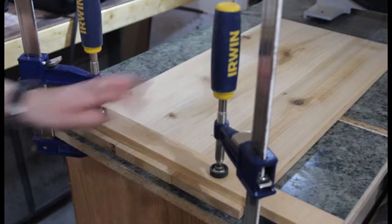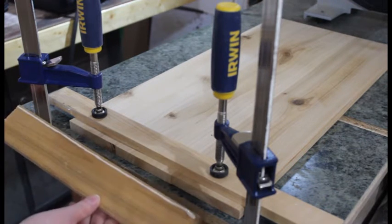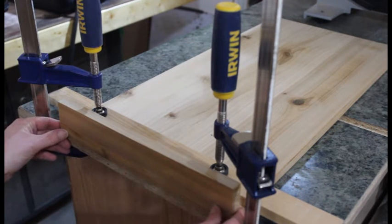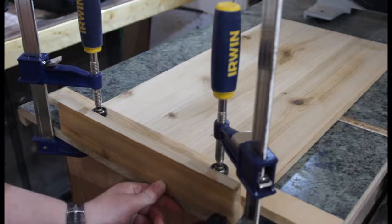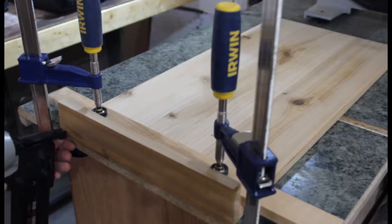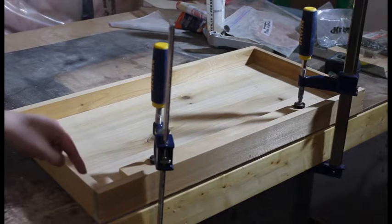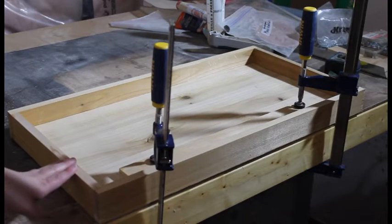I forgot to mention that you do want to sand the top and bottom before installing your side rails. I put a little dab of glue — I had to clamp mine down a little because my boards are slightly warped, but once everything is together it'll be okay. I'm using 18-gauge inch-and-a-quarter nails, one on each end and one in the middle. For the long pieces I lined up one edge, made a mark, cut it at the saw, then added glue and nailed it up the same way.